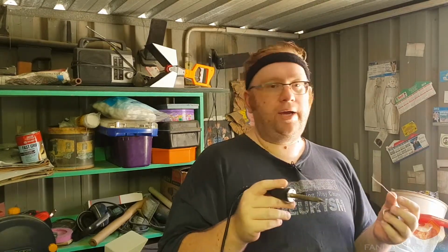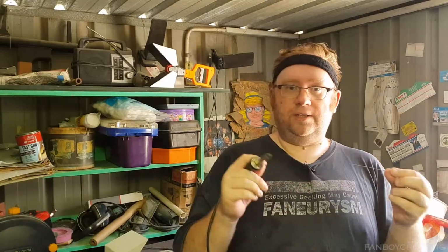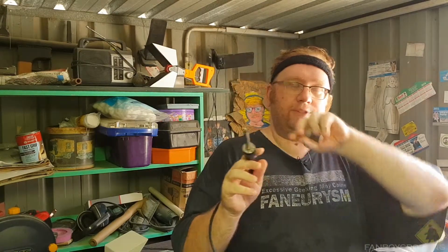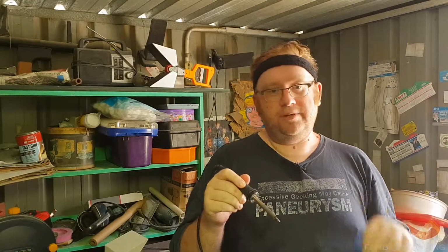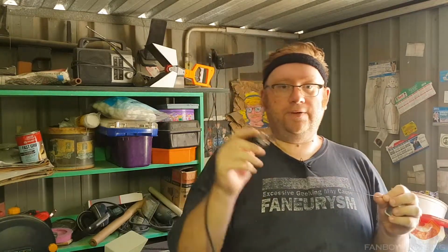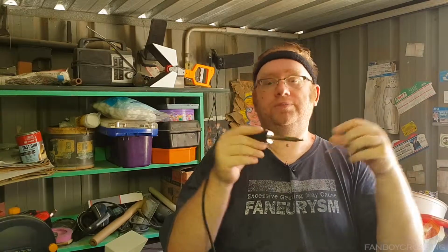You can get away with maybe using some alligator clips to absorb some of that. That can be finicky. You can add a little bit more solder if you're not too sure, but again, you don't want it to be ballooning. If it's odd shaped, you can sometimes add a bit of heat, but my tip is, if you don't think you've done a good connection, don't immediately try and fix it. Let it cool down for a bit and then reapply and add a little bit of solder, because the flux in the rosin will help it cure again.